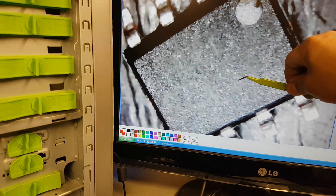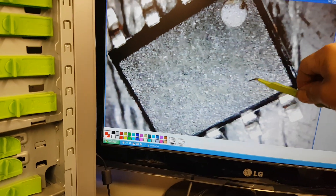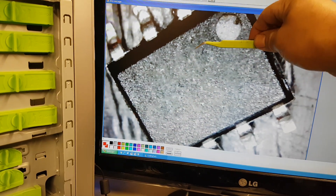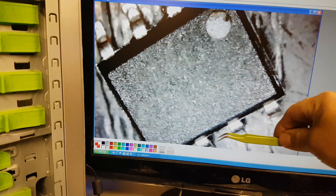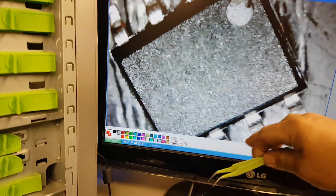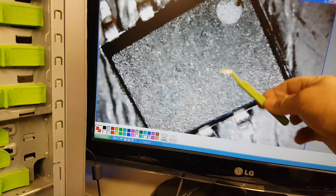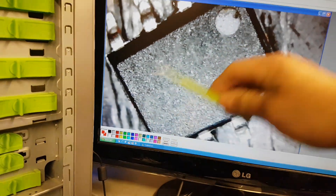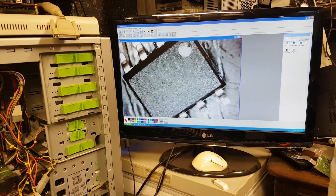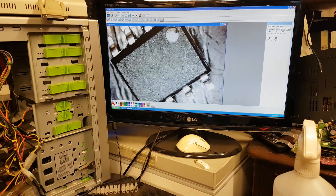Another way of doing it, which I usually do: the letters are facing upside down — you can see '4', '1', '2', '8' — which means it's upside down. So when you put the chip in the correct orientation with the letters facing correctly, bottom left is the first pin. As you can see, if you turn the chip around, bottom left is already marked as pin number one, and it also aligns with the letters in the correct orientation.